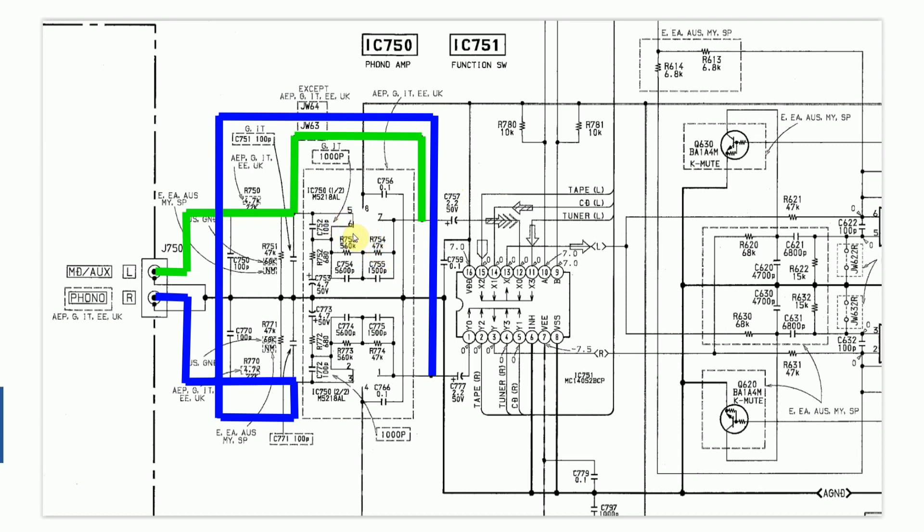I also had a thought that ideally we'd want to disconnect all of that circuitry from the input to these chips, but I decided to leave it for now just to test whether this works. Ideally you'd probably want to remove this resistor and capacitor here as well, to disconnect these two pins from feeding the switching chip, and do the same for the other channel. I may do that at a future date just to make sure there's no extra noise fed into the chip.